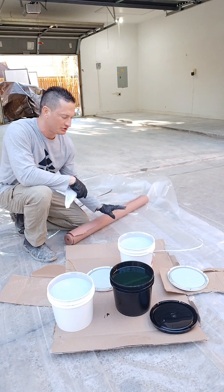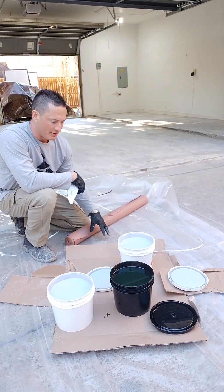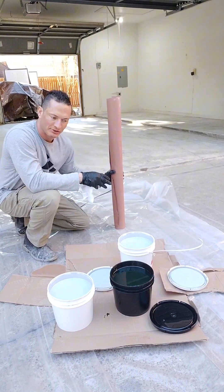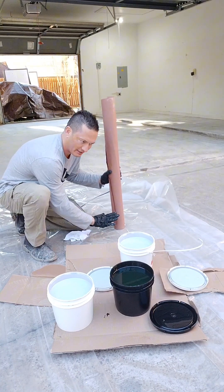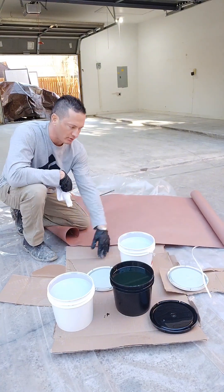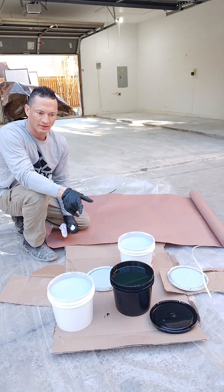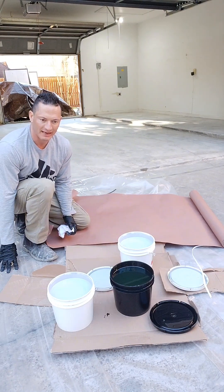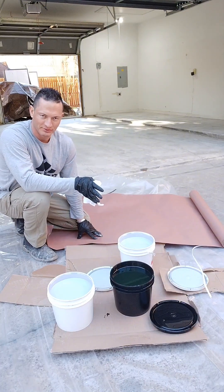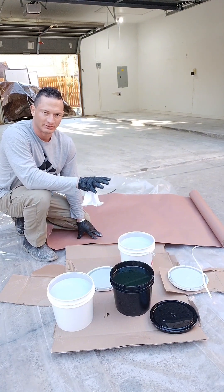For workspace protection, use plastic tarps — these plastic sheets are three and a half mils. But even if you use something like this for a driveway and you spill epoxy on it, you've got about 30 seconds before it penetrates. So pretend like this is concrete — this is just a backup in case you spill something. You want to work on cardboard or parchment paper. Any type of paper is fine. Do not mix up anything on a customer's driveway or on these thin sheets of plastic. You don't want to be the person who ruins a customer's driveway because you're too cheap to use cardboard. Think about your reputation — that's really important.